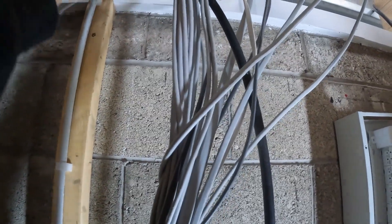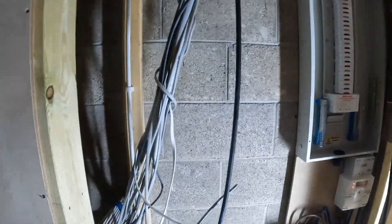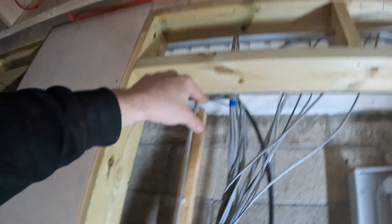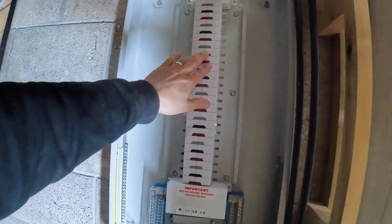We can't put a 90 on though, because we'd have to chop into the top of the 90 to get those data cables in. I think the best bet is just to literally butt one piece up to the other without any kind of angles on, just so we can actually get into that top cable entry. Hopefully that makes sense - let's crack on with that. We'll get this fixed next and then have a look at getting the trunking cut out.